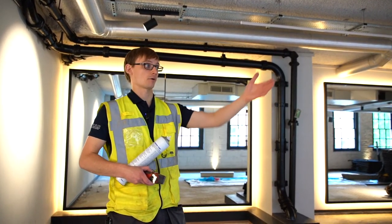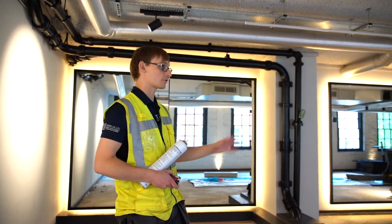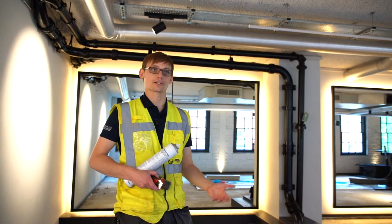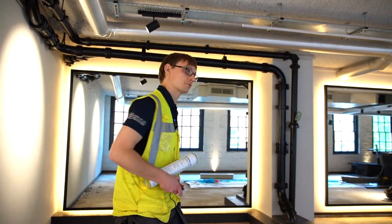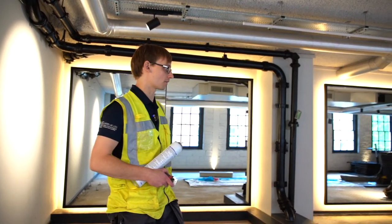It's a very nice space, but you've got bare brick walls, bare columns, which looks fantastic but is very bad acoustically. The energy goes into the structure, resonates straight up through and rattles the floor above — and that's basically the issue they've got.